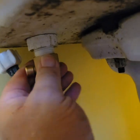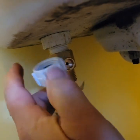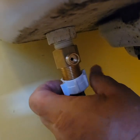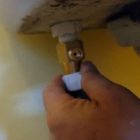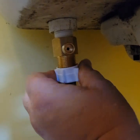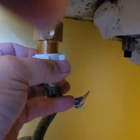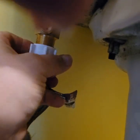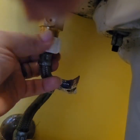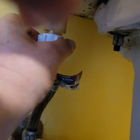This valve has been on here 30 years. I'm going to try to get it to go forward like this because that's where it's going to end up — the bidet water is going to come in that way. I'm turning this backwards on purpose, waiting for that click to make sure it's threaded right. I got it hopefully on there — nope, it's not on square. Again, you don't want to cross-thread this one either. Okay, there we go — we've got the water hooked up.